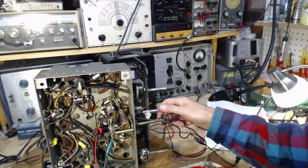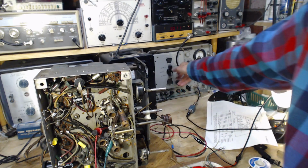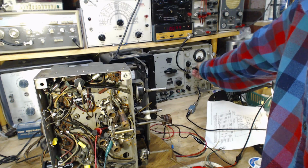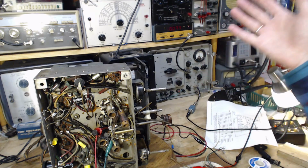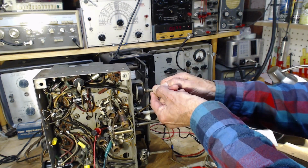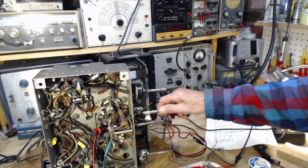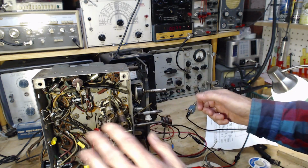Shortwave. Right, now we'll tune to 10 megahertz. Okay, we're at 10 megahertz. We'll check the signal level here, or the output level rather. Calibrate it. 10 times 10. 100 microvolts or something like that on the antenna. Pretty quiet, isn't it? Not an impressive showing here. Yeah, that's a little better. I like hearing the hiss.